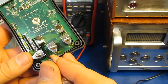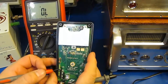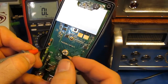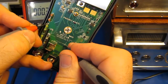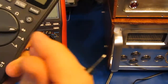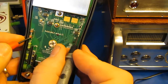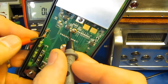One of the things I've been asked is if I run the meter again at high voltage with this insert installed, does the meter break down? So I thought I'd trace out some more of this meter. I've got the Brymen out and it's in continuity mode from the input pin, basically across this gas discharge tube. That connects over to this small trace right here, goes to here, and then goes into the selector switch. Depending on what mode it's in — if it's in diode mode, we can see it goes over to this TVS right here; if it's in resistance mode, we'll see it goes to this TVS.